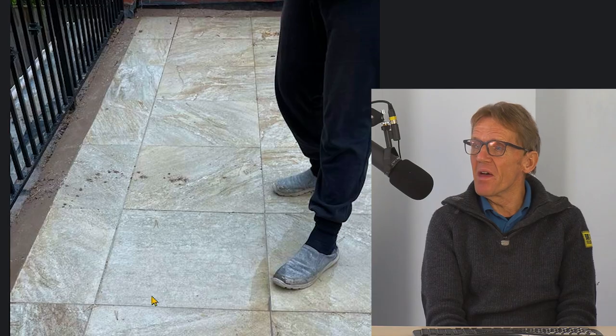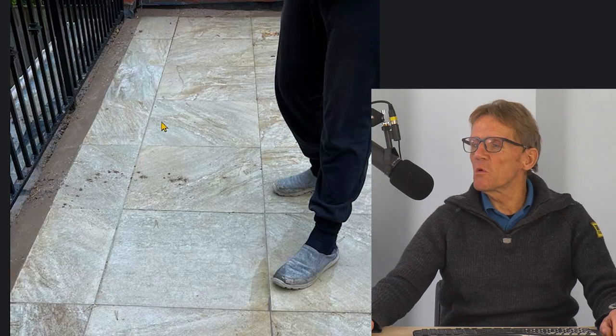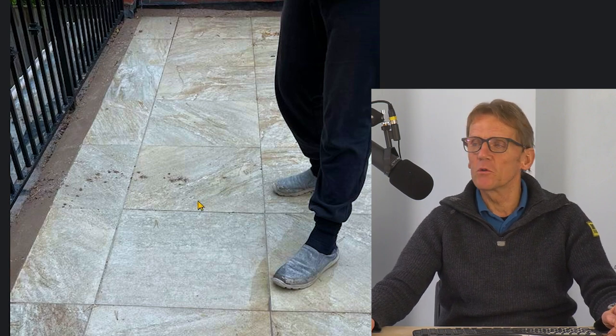The thicker sort of tile that you would use — exterior porcelain paving slabs — would really be a better bet. But you need to do the job properly, and when I say properly, it needs to have a really good membrane down, and then maybe some sort of support so that if the tiles did leak, they leak through to a cavity or void underneath where they could drain away. You can get all kinds of systems — like little chair legs on the corners — that allow you to put four tiles into one leg and cover the whole lot.